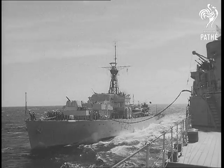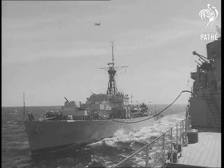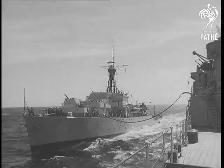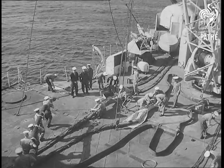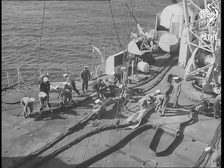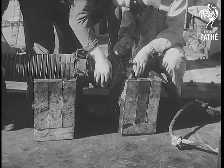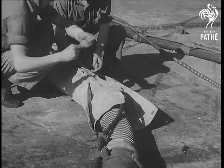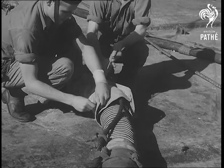This rig is an adaptation of the large derrick rig for transferring fuel from a warship or an auxiliary only fitted with a small derrick to another warship. The rig shown here is the crane rig of a cruiser. To assemble the rig, the necessary lengths of hose are laid out on the supplying ship's deck and connected up. The hose is slung by two troughs only, where it is protected by canvas gaiters or matting.